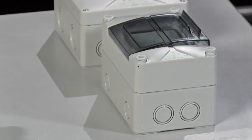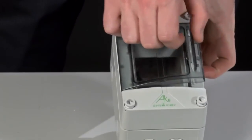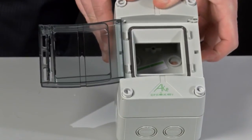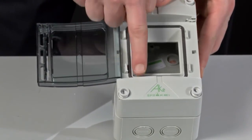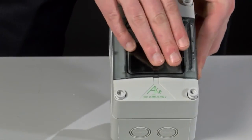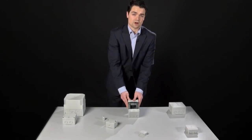Some applications, such as circuit breakers, may also require a lid which can be easily opened for access to the internal wiring. Again, you're going to need to think about what level of ingress protection you're looking for, but ultimately you'd expect to see a good rubber seal and a nice clasping grip to make sure that the dust and moisture level protections are maintained.